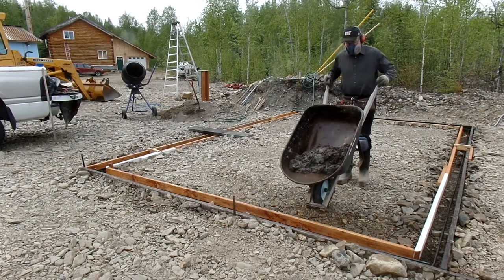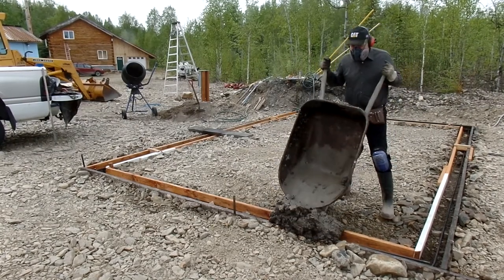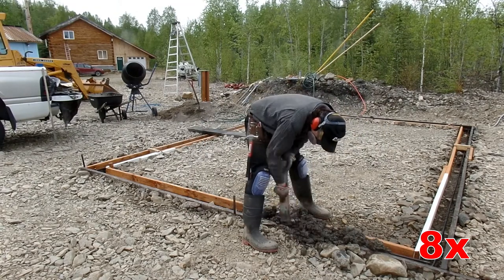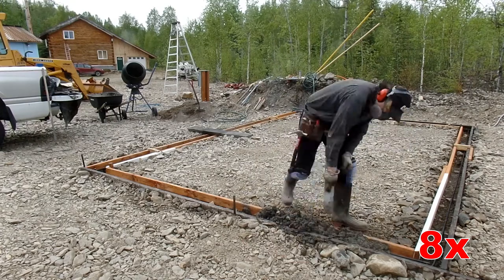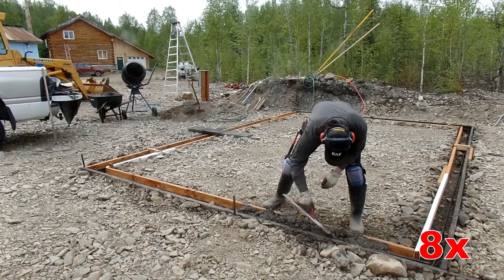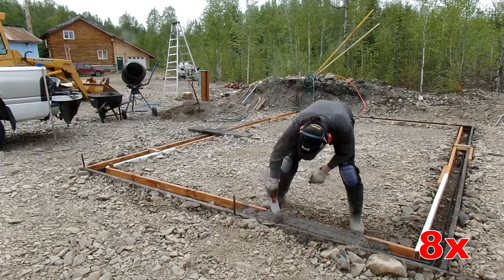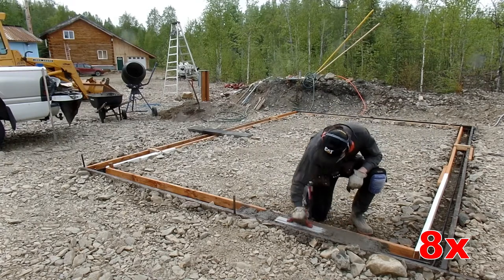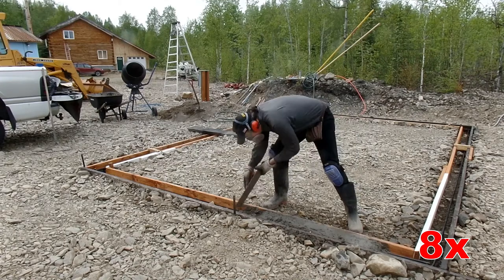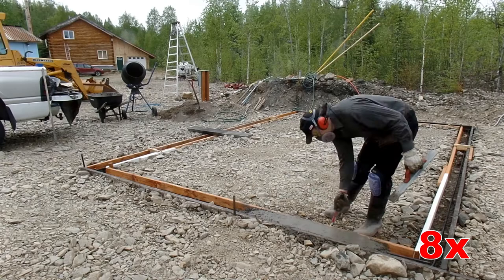The forms are tiny — they're six inches wide, so I really overshot. And you can see this looks more like gravel than it looks like concrete, right? It looks way too dry — it doesn't even look like this is going to work at all. Concrete has to be consolidated into a single mass, and it doesn't really look like it's going to consolidate. You can kind of see once I hit it with the bull float enough. It was work getting this thing consolidated because there's almost no moisture in it — gravity is not essentially doing any of the work of consolidating this concrete.